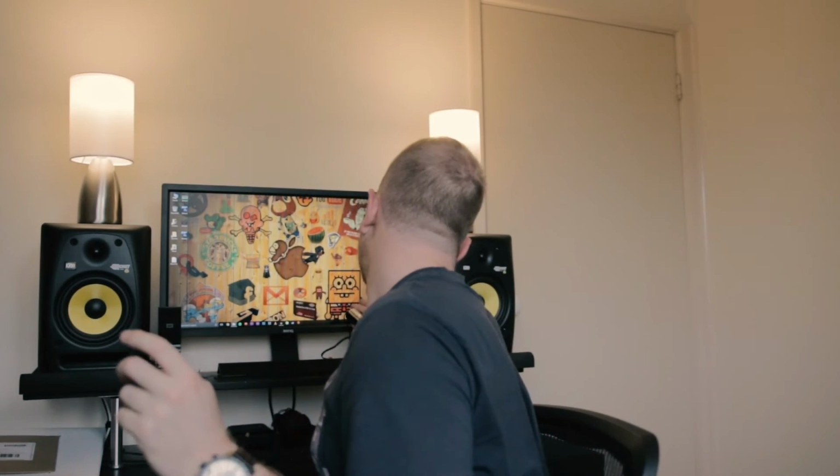So if you guys ever have any sounds through your sound system that sound like what I showed you, when you have big external speakers like these that don't just plug in via an audio cable, like an RCA or an XLR, those sort of big powered speakers, go and get a, I'm going to use the correct terminology for it, ground loop isolator. So you don't have to get a big, proper, expensive thing. That was $17 from a local shop down the city. I'll put a link in the description.